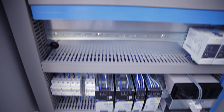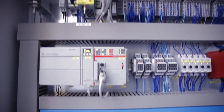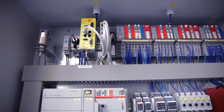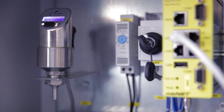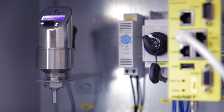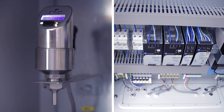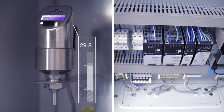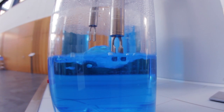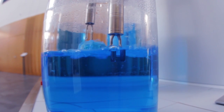To make sure that all the components of the cabinet work properly, Endress & Hauser has also built a temperature sensor into the cabinet to log the high and low temperature warnings. It's very important to have a proper working temperature in the system. If this is not the case, it could, for example, reduce the capacity of the UPS battery.